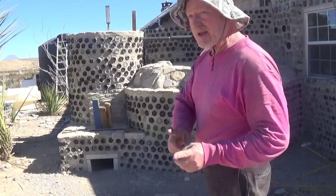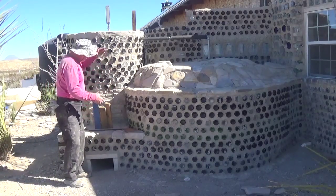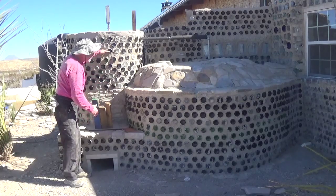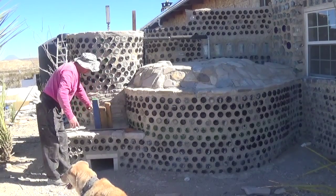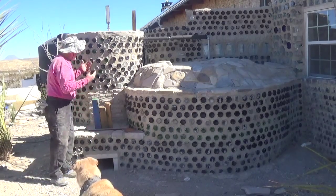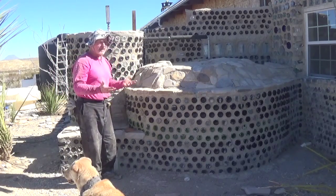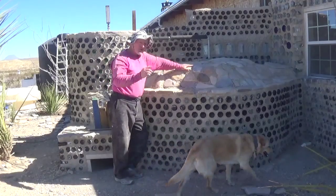Then I'll explain why we're talking about it on the bedroom wall build. The principle of a rocket stove is that it takes in the fuel vertically, burns horizontally, and the heat and smoke come up and hit a top where they overflow and go back down again, creating tremendous heat up top. The exhaust goes out the back at a low height, extracting as much heat as possible. I built this thermal mass, but we don't need the thermal mass for heat — what we need here is hot water.